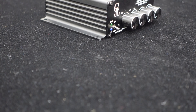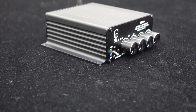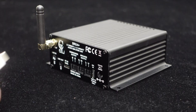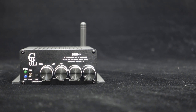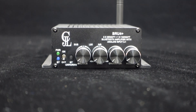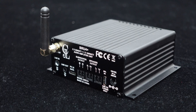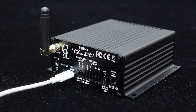BRU-4 Plus is a 2x50W plus 1x100W 2.1 mid-power integrated amplifier, also featuring Texas Instruments TPA3116 amplifier chips. BRU-4 Plus offers a USB-PD Type-C power interface for PD charger support. Unlike BLV-D3, BRU-4 Plus utilizes the BP-1048B2 Bluetooth 5.3 chip and an audio DSP module with independent bass and cut-off frequency adjustment knobs. Additionally, BRU-4 Plus supports real-time tuning using a USB cable to connect to a computer.